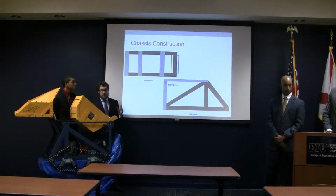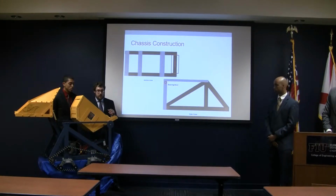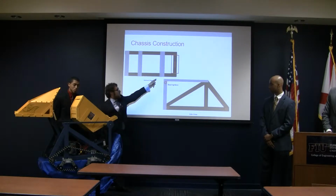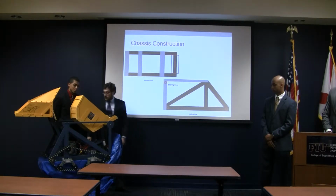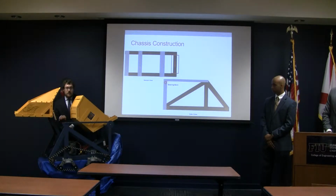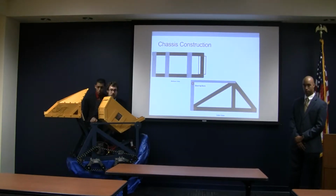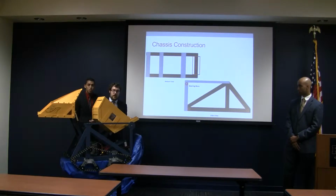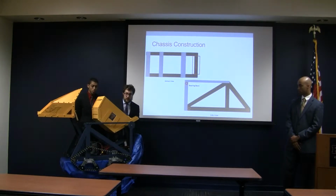In order to break the curse, we began by modifying it. We began by cutting the forward arm and replacing it with 2 additional aluminum beams. You can see the beams here on the robot. These beams not only serve as the replacement for support for that beam, they also act as the support for the gearbox mounting and the forward arms.